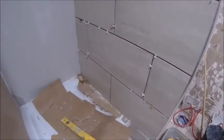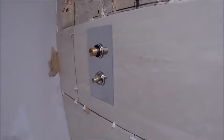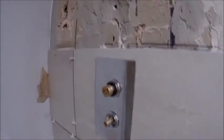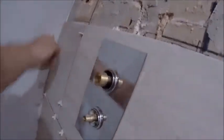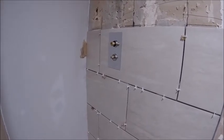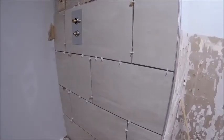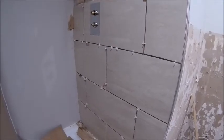Done a bit more tonight. It's slow going because there's a lot of cutting and messing about. I took my time because if I cop that up it's game over for a tile. The tiles are stone-based so the problem is cutting them - I had to use the grinder with a grinding wheel. The next issue is the hole for the shower head holder - you can't drill them. I've tried all sorts of drill bits. I need to do some research, test on a scrap piece first. Getting there slowly - relatively happy with tonight's work.